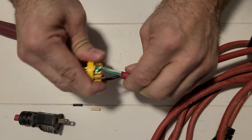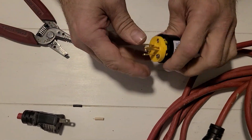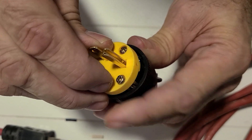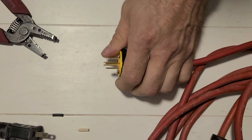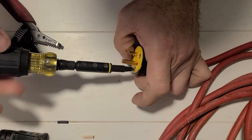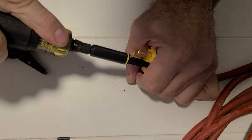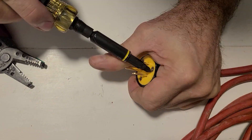I'm going to center these up — grab the insulation so they're all nice and even, not wrapped around each other. Then I take the body of the cord cap and pull it up. Most cord caps have these little tabs on them — you look on the body, spin it around, find where they line up, and seat it. I can see the blades inside the body. On the screws, barely start them first so the body doesn't go sideways on you. Then start the next screw, and once everything is started, tighten them all down and snug them up.